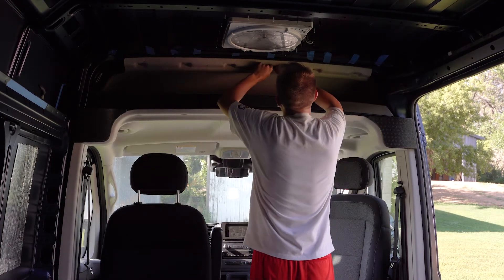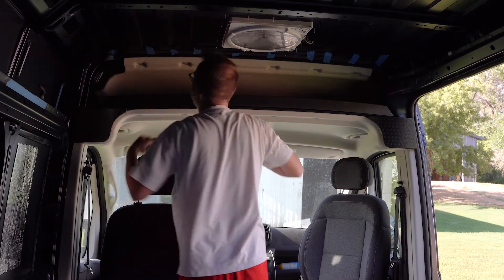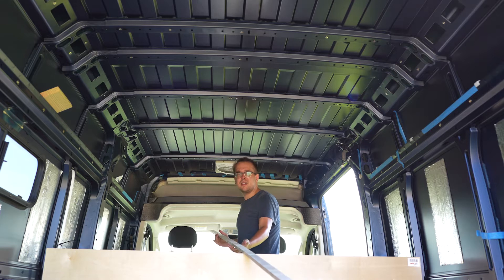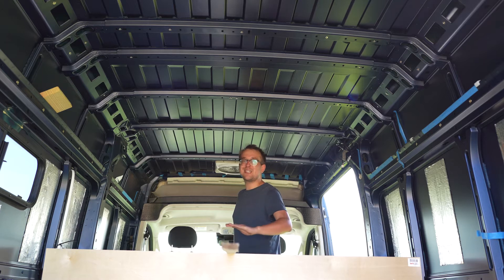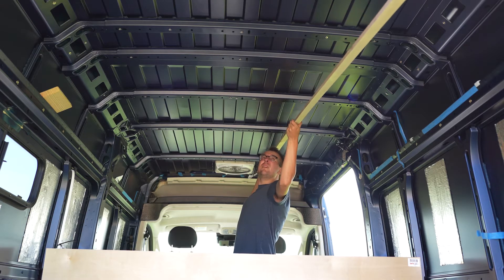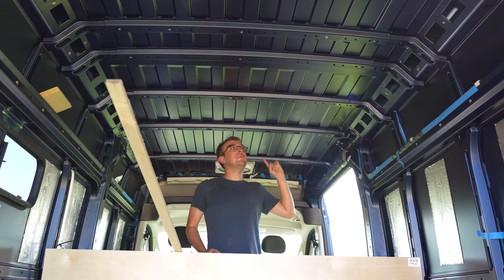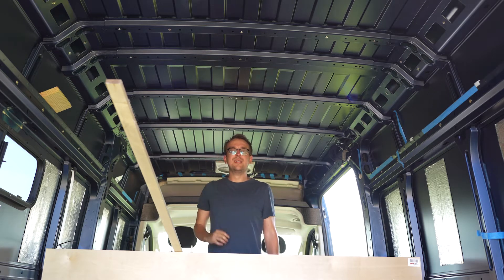Maybe these aren't the worst clips ever — they're super easy to get back in. Impossible to take out though. I've got this really long piece, like one by one and a half. We cut a two by four — like a 16-foot two by four — down to about 12 feet. The goal is to put this up to the roof and have this be my framing for the ceiling. Starting on these rivets: 140 inches for this beam across. I'm doing the framing the long way, which makes more sense because I'm just putting up plywood sheets across — that's my whole ceiling idea.